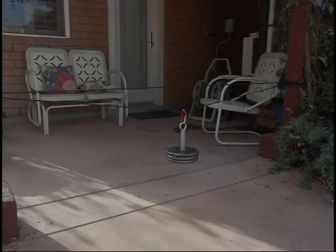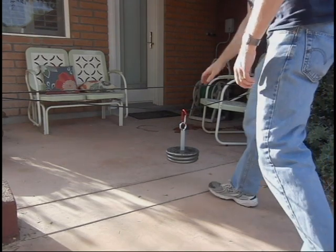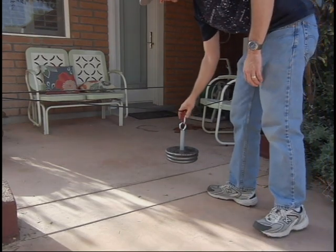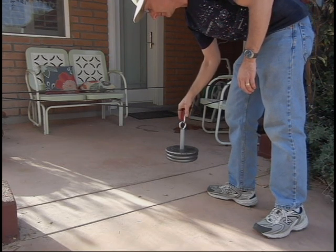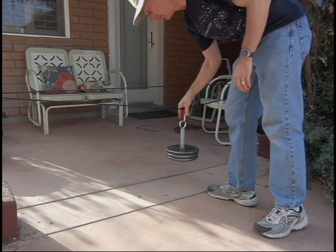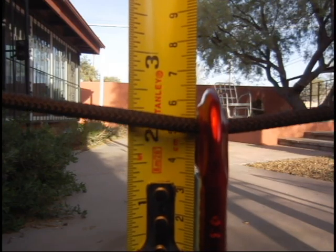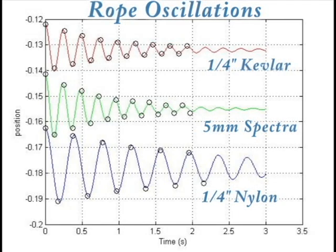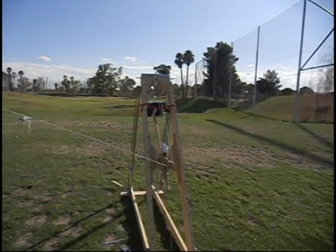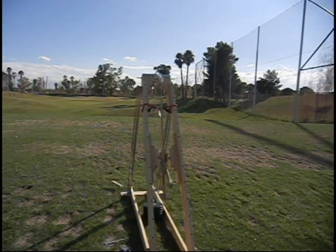So I'm forced to break new ground. I've been assuming that ropes act like a spring with very low damping — but what if that's not true? I can't find any rope damping data on the web, so I run my own experiment: stretching a cord between two columns with a 30-pound mass in the middle and setting up a bounce. I measure spring coefficients for a variety of ropes, driving a model which matches the empirical data really well. Except when I plug this carefully extracted data back into the sim, it only accounts for about a third of the missing energy. I've still got 100 joules of vanished energy to find.